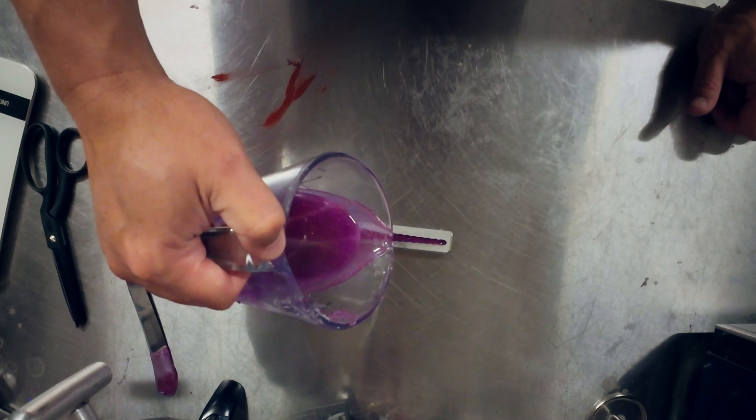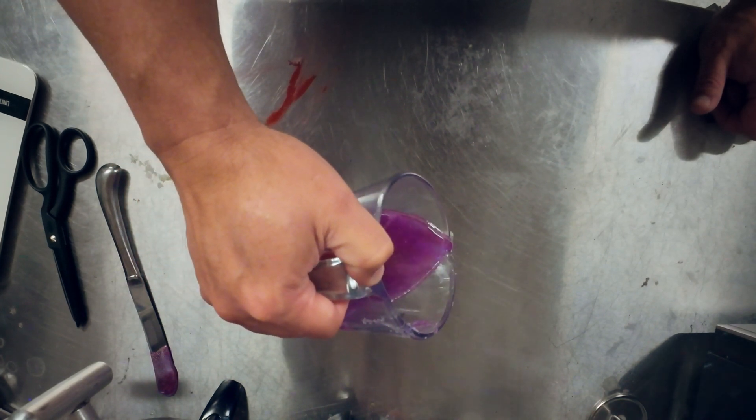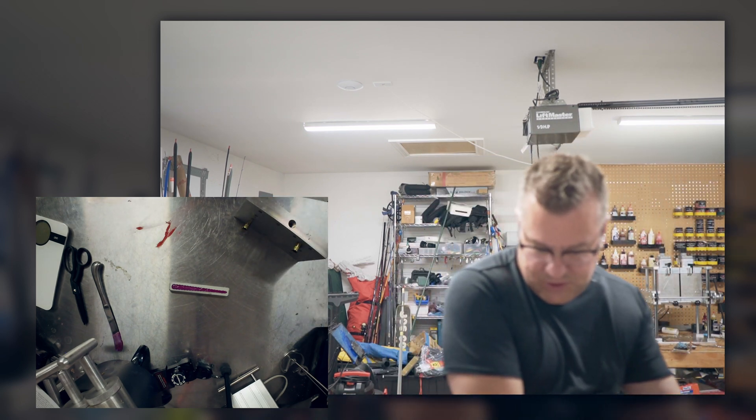It's not really that hot, which I think is not a great sign. Aluminum is kind of the champion of heat dissipation - aluminum wicks heat insanely fast, pulling the heat out of your plastic and into the mold, so your plastic cools faster and you can get a lot more shots. The fact that this steel mold is not that hot means the heat is kind of trapped inside the plastic and has to naturally cool itself out. The back here is not quite all the way to the top but the bass won't care.